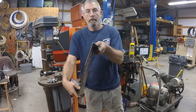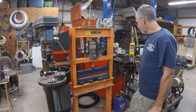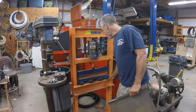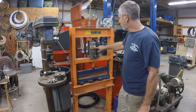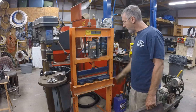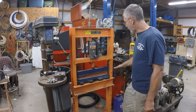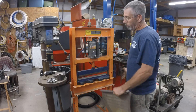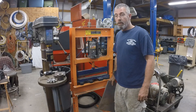Those are the mods for the Harbor Freight press that I've done. Straightening out these press plates — they're cast iron and I flattened them on the mill so they don't rock all over the place. The air over hydraulic bottle jack was a huge plus — it's a godsend. It's so easy to bring the table up and down now, especially when you've got stuff laid out and don't want to take it all off just to lower the table. It raises and lowers fairly level. If you've got any questions, let me know. Thanks for watching.